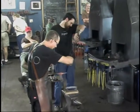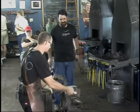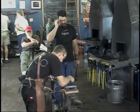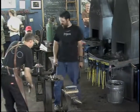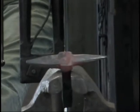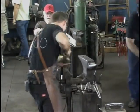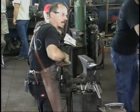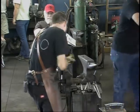And hammering around there, holding it to the sharp shoulder of the anvil, and working with the set hammer, which has a slightly rounded edge, working it in that. I did clip a little bit on the shoulder earlier when I was swinging the hammer. I'm going to figure out how to grip it and take a little bit of that off right now. I file these shoulders back a little bit anyways. I just try to keep a nice line, crisp as possible. I try hard not to fold anything, but I do file them later on.